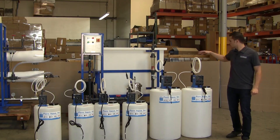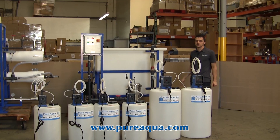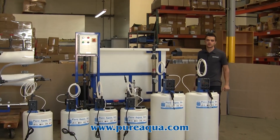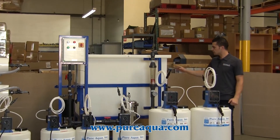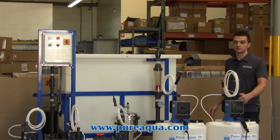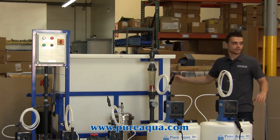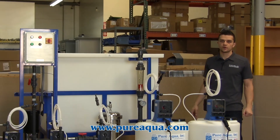For longer periods of maintenance, we have a CIP system which we predict will be used every three to six months — six months at the higher end. This system will utilize more concentrated chemicals compared to the CEBs, providing a more enhanced and efficient clean-in-place on the UF module surface.